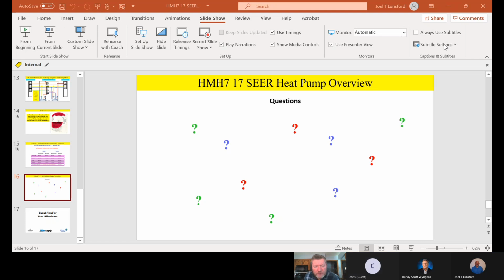Okay. So if I'm hearing you right, you're telling me that the homeowner doesn't want to replace the furnace and it's 15 years old and it's a Lennox or some off brand, that there is a possibility it's not going to work and we need to actually have that conversation prior to. Absolutely. Yeah, we need to have that conversation, because if you don't have the capability of doing an airflow reduction on the indoor unit, then you kind of wasted the capability of the outdoor unit.